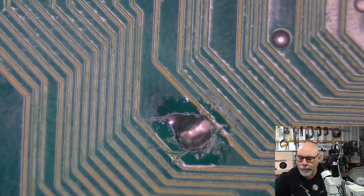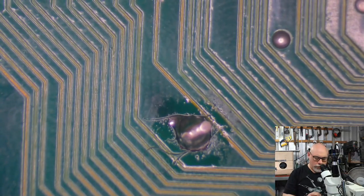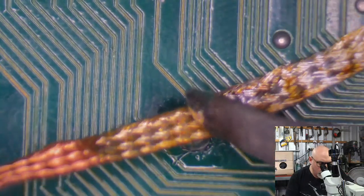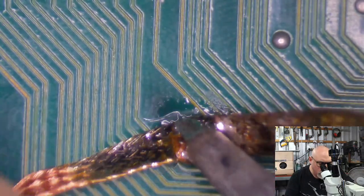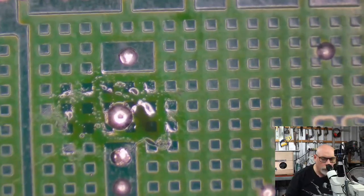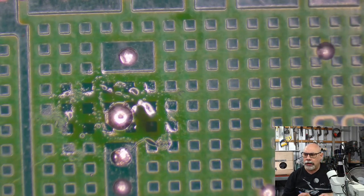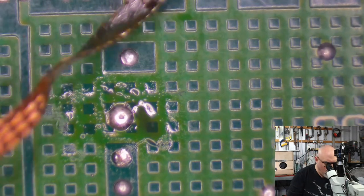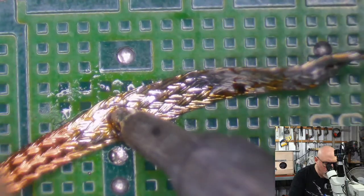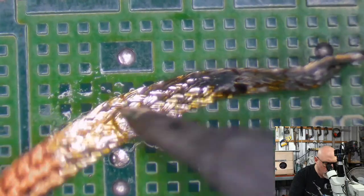Okay. All right. All this solder hanging out the bottom. See if we can clear it. Yay, that one's empty too. So we've got two empty holes there. This is the trouble one, wherever it is. There it is. This is the trouble one because it's on that plane of copper. Hard to get heat there. So I might have to do all my tricks to get this one empty. But you never know, sometimes you just get lucky.